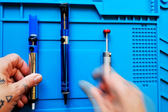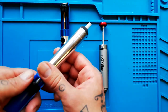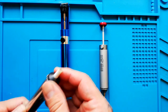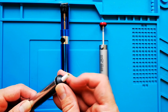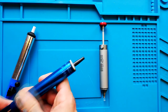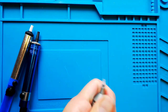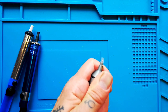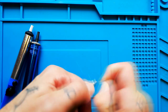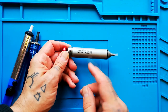Initially I was pretty pleased with both, but frankly they've both got a problem with blockage. When you push that out, the pin at the center comes all the way out of the nozzle, so if you've got blocked solder in there you can push it out. This one works more or less the same way — the pin comes all the way out of the metal socket — but basically you've got a length of silicone tube here.